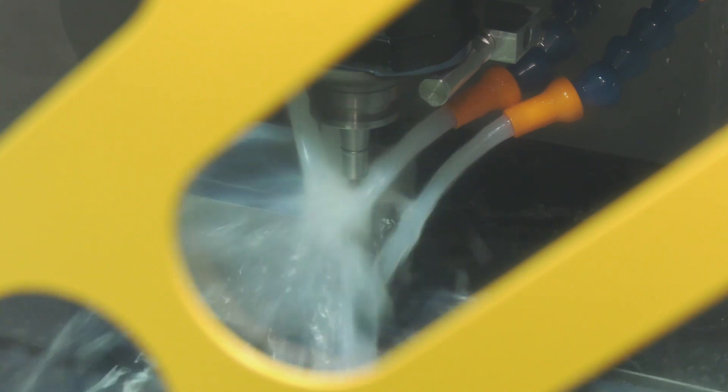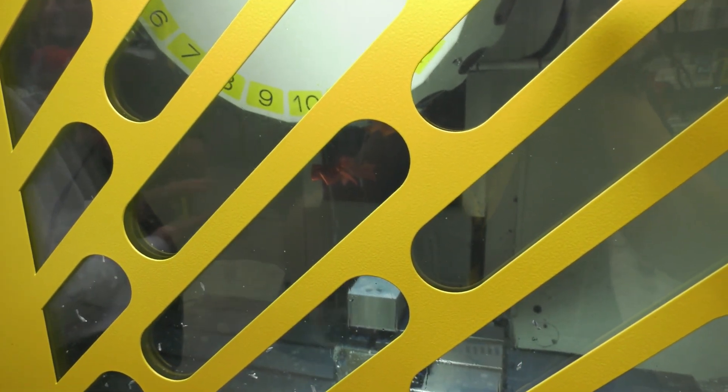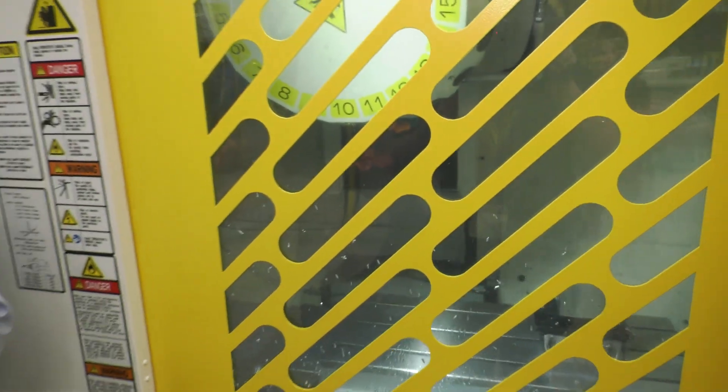These aren't just seen in test environments — there is a real-life application. In a production environment where you're trying to keep production and robot loading going, you need to clear the swarf out. Whether there's swarf on top of the component or around the machine itself, you need to clear that. The chip fan allows you to blow the component off, wash it off into ports or bores, which can then be offloaded by the robot. You can bring the chip fan back in and clear down the device or application area, then reload knowing there are no chips impacting on the holding of the workpiece.